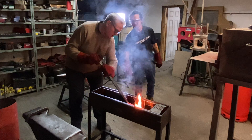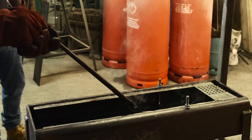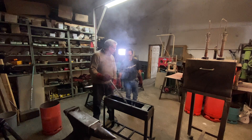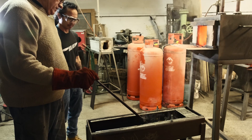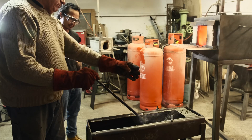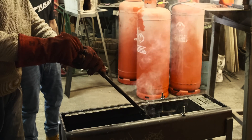Keeping him level, you put it onto the bar, and you keep the back of the handle just above the oil. That's just from experience — we know that if we keep the back of the handle just above the oil level, the whole blade is sitting at exactly the right angle to give us the right depth of hardening. The main body of the blade in the centre is still red. We're going to wait until there's absolutely no sign of red colour at all — about another 30 to 60 seconds. Now if any of you ever watched Forged in Fire, that's about the right level of flame and smoke to properly harden the knife.